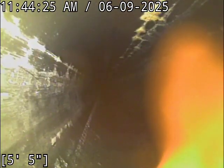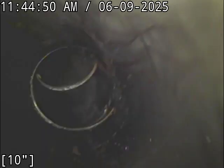And you can see here, what I can tell you about this home, just from doing 25,000 sewer inspections, this looks like a hot water house, where you wait for your hot water to get toasty warm before doing your dishes. The reason I can tell that is your interior pipe here is nice and clean. The pipe through your crawl space is suspended in the air. It's well insulated, so that water stays hot going through the crawl space, as does the oil and grease it's carrying. Once the pipe hits the exterior where it's buried underground and it's cold all the time, that grease starts to rapidly cool down, as does the water that carries it, and so it starts to all harden up on the outside of the home.